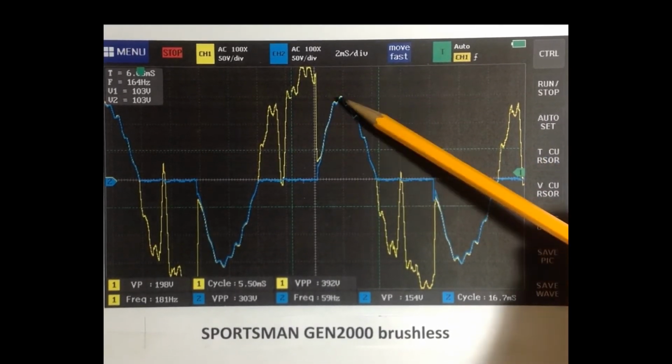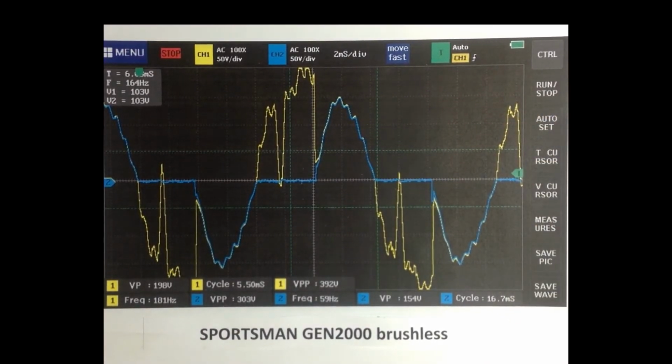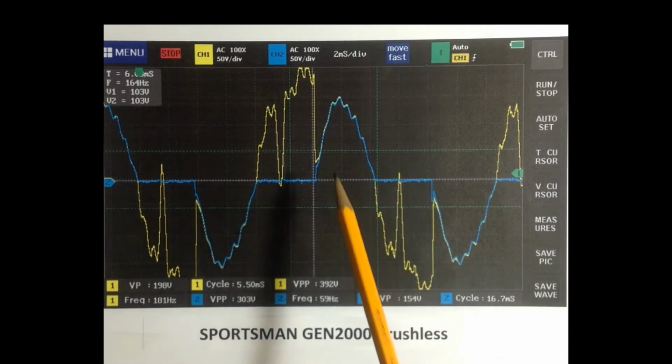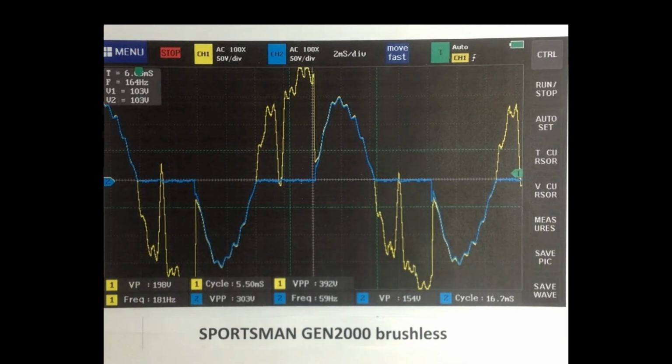And from here to here would represent a transient. I guess the power underneath this voltage curve, from here to here, would represent a much higher frequency voltage change, and any capacitive device would tend to draw an excessive amount of current because of the higher frequency. Of course, this dip applies twice in a cycle, although this unexpected increased dip here is also very significant. So if you had a harmonic analyzer, which I don't have, it would represent a really high quantity of transients.